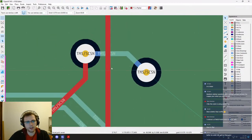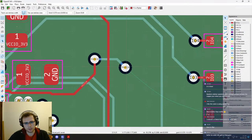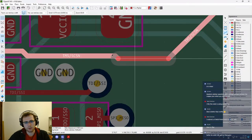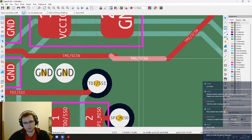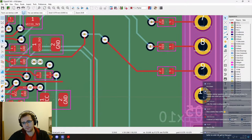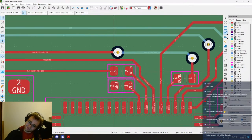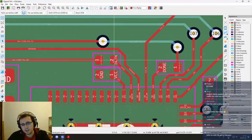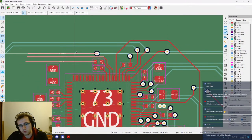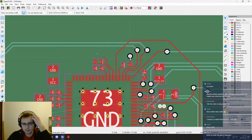It's doing weird things with the vias. It's not always creating the track on the bottom layer, except if I move before placing the via, which is a bit weird behavior and unexpected. This like that, okay. This, what is it? Init and program and init and those need to be rerouted, of course, to the other side of the board too. So maybe we don't. Yeah, let's see how we handle that.